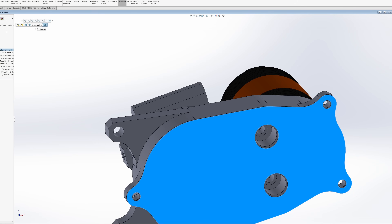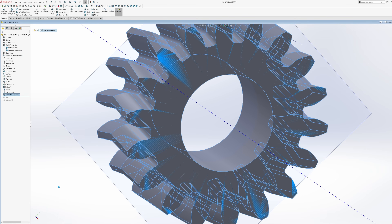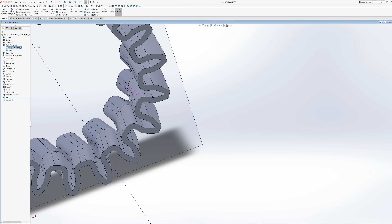Now if you're doing your own work in CAD, this is easy. I just took my CAD model — let's take a really complicated thing, so I've got a herringbone gear. A herringbone gear is basically a helical gear that's flipped in the middle and they're self-centering, which is really great especially with the tolerances in 3D printing. So if you clone your part, most CAD software has a shelling tool and we shell it to the thickness we want — just a smidge thicker than what your nozzle will do. If you have a 0.4 nozzle, you usually have to do at least 0.43–0.45 mm wall, so to give yourself a little room, call it 0.5. And now we've got the exterior wall. I'm not doing the top and bottom just so you can see that these are two materials.